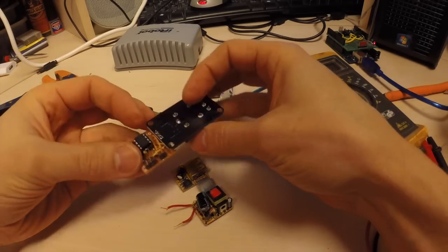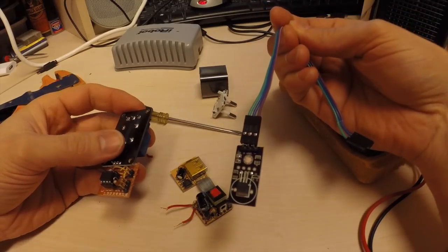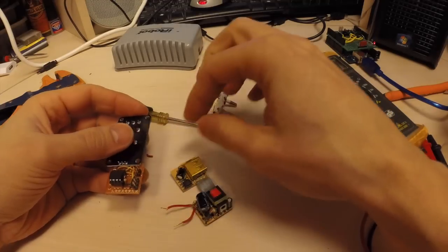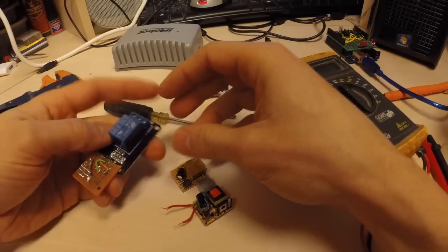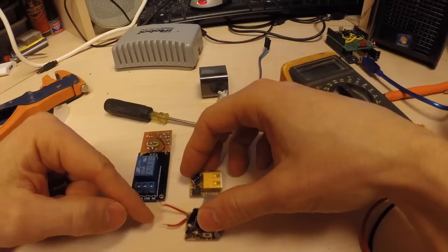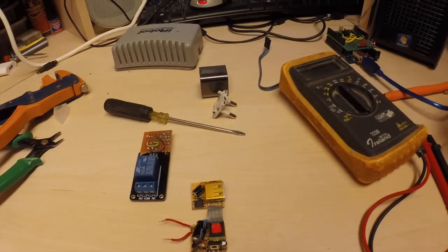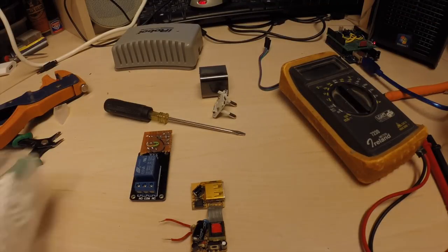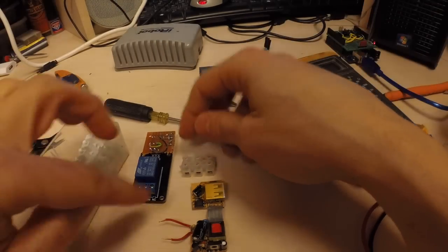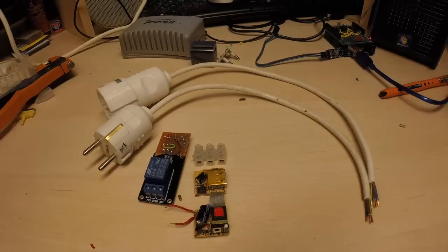Let's cut this, and then we have our circuit board here with our relay and our ATtiny, and connected here is the DS18B20 — so 5 volts and ground here. We are going to connect the power here, and we're going to use some of these headers to make sure that we get power to all the places that we need.